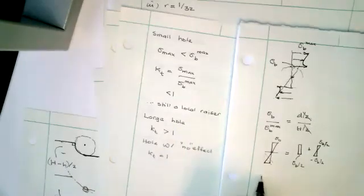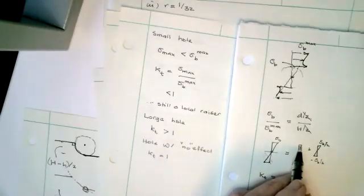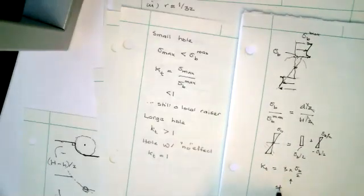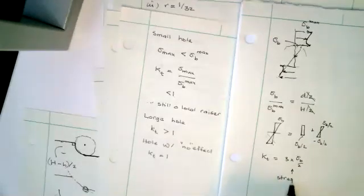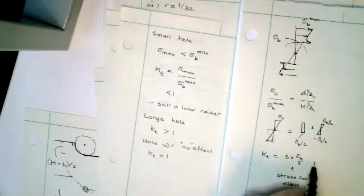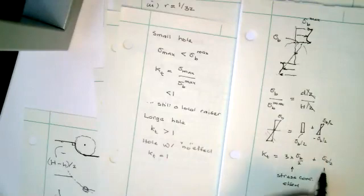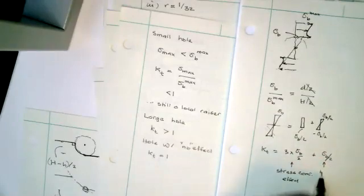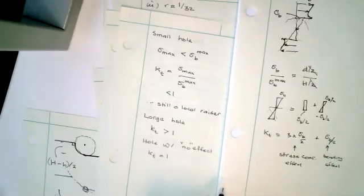And so here's my rough estimate of KT. This is the average stress through the hole. I'm going to say that's like a hole under uniaxial tension. So I'm going to multiply by 3. That's my stress concentration effect. And for this one, I'm going to say there's no net stress here. So I'm just going to add the bending at the top. And if I do that, then KT,